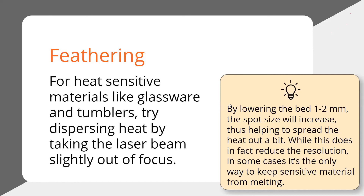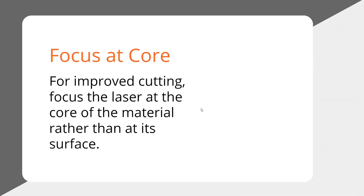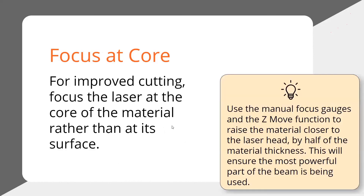So that's just ways you can play with your spot size — we're thinking of ways of controlling the heat. Playing with your focus can do that, and vice versa: if you're trying to cut really thick material, sometimes you want to put that really intense focal spot into the material, not on the surface. When you press auto focus on your machine and bring it into focus, it's putting the most powerful point of the laser onto the surface of the material. When you're cutting, that's not really where you want the most powerful spot — it will work for thin stuff, but if you're getting into three-eighths or half-inch material, I recommend you raise the bed up so that focal point ends up in the core of the material, right in the dead middle of it. That way you get your most powerful point of the laser beam inside it, and the strongest parts of the beam leading up to and out of that focal point are covering the rest of your material.